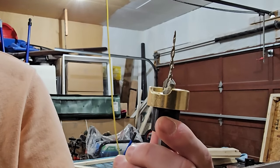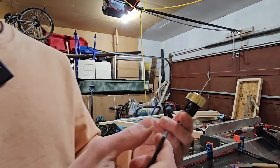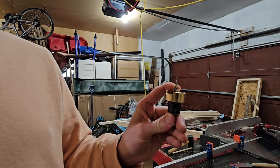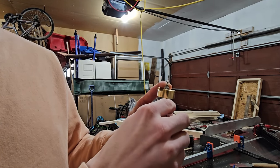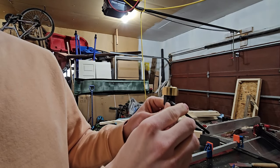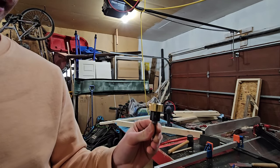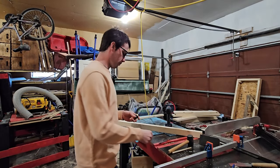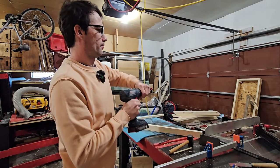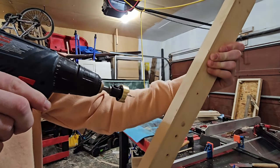Essentially how flush you want your screw to be with the wood you're sticking it into. Now for a demonstration. I'm going to be using roughly one inch screws, so I've moved it to here and I'm going to lock it with just a little turn, and now it's not really moving anymore. On the top I want our screw to run flush with the wood, and this should be fairly close to accomplishing that. I've grabbed a couple screws and my drill, so I'm just going to lock this in and bring it over.